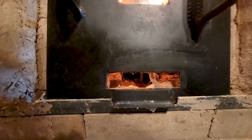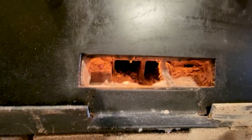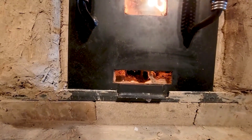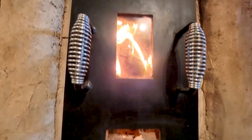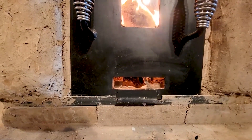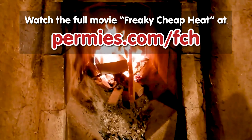There's a little double tube, and it deposits preheated air into the exhaust to burn up whatever's left of flammables in there, instead of sending them out to be pollution or stick as creosote to the inside of the chimney — we don't want that.